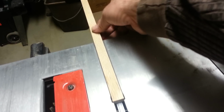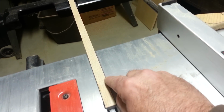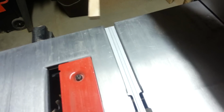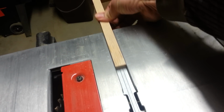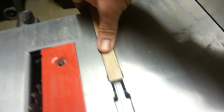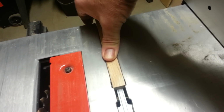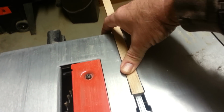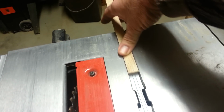Okay, I've made the slider exactly a hair over 5/8 wide, and tested it out, put it on the other end so I have enough room to make the length of it and keep it down. And it seems to come out perfect. There is no wiggle or wobble, and it slides quite readily and smooth.